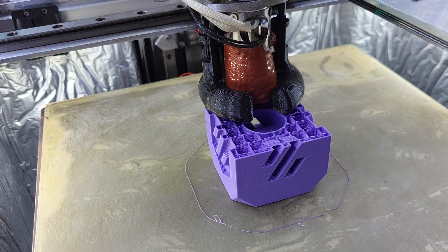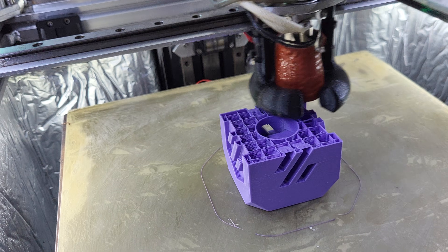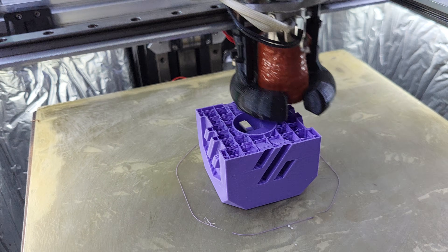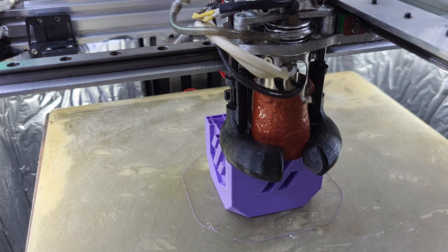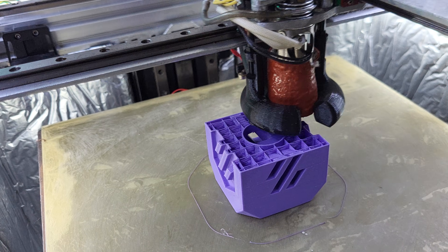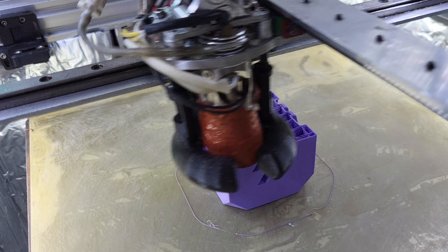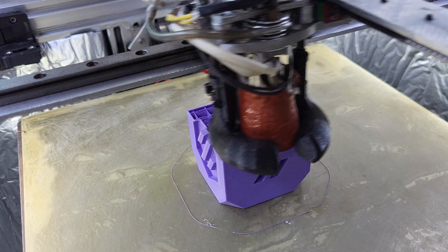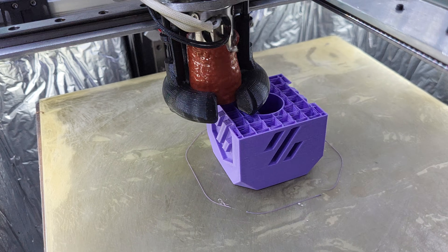At the 100mm test I usually need around 0.92 flow, but if I go faster — 500 mm/s — I usually need to increase that to around 0.95. That may be due to temperature: it seems to be flowing better and I'm getting the extrusion I need. I'm extremely close to the slicer's projected grams used at a flow ratio of 0.92, so that's a good thing. The bad part is needing 320°C to get 80 mm³/s of flow.